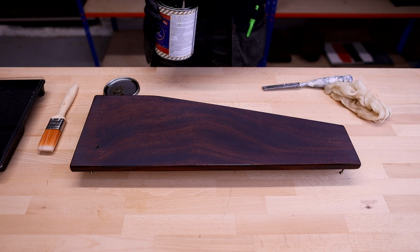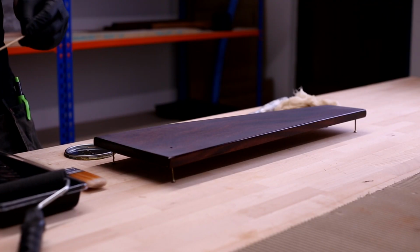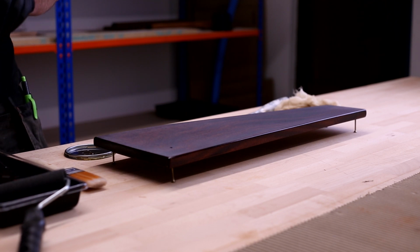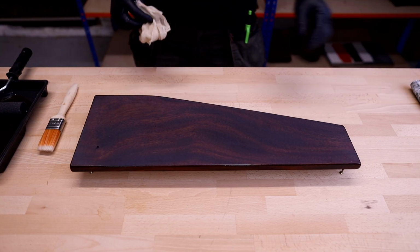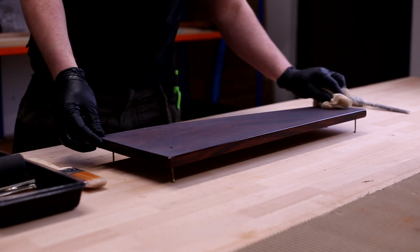So tipping is nearly always done with a brush. It tends to usually follow on from a roller process. Most people would roll varnish onto the surface and then tip it out with a brush. This is usually a good way to even out the texture that is laid in place with a roller.